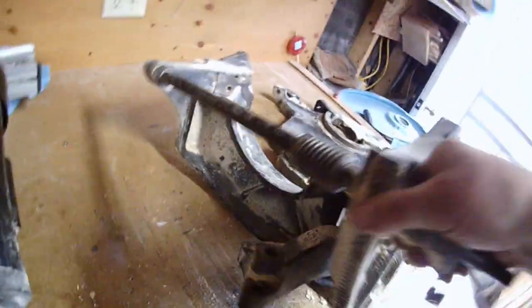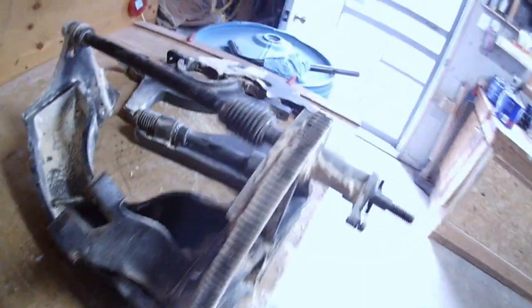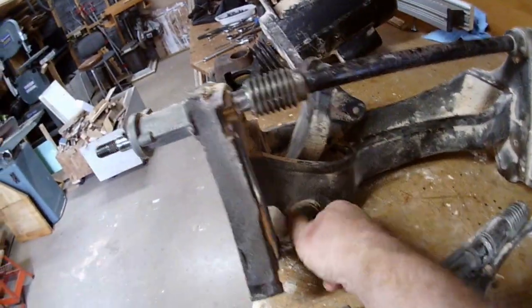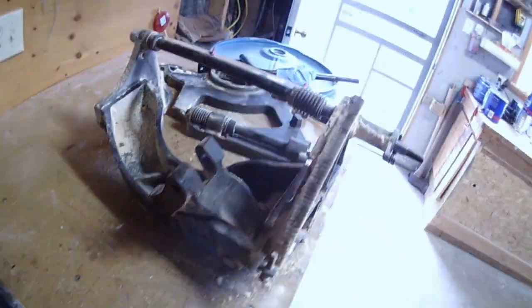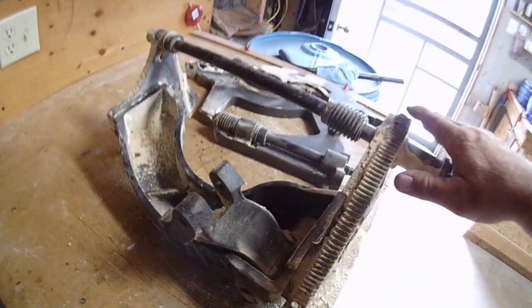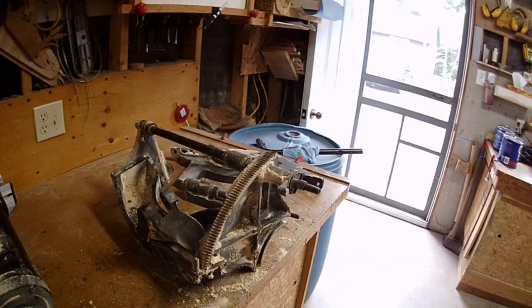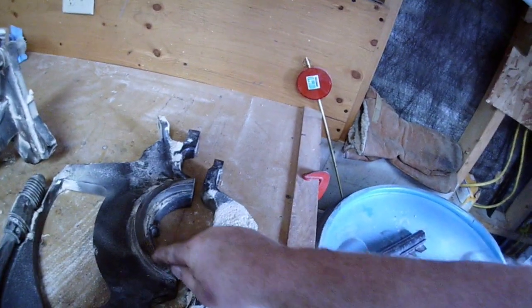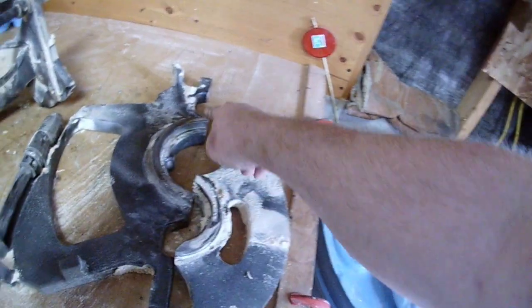This hanger that the motor hangs on is just mounted on a shaft. I'm going to try to get that shaft out — it's a big honking shaft. I'll clean it up and see how lubricated it is. I'll also get lubricant when I'm in town, because where it's very dusty you don't want to put oil on it — it'll just hold the sawdust even worse. These trunnions need to be cleaned well and have a nice lubricant put on them.